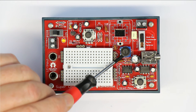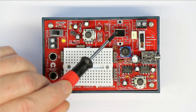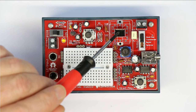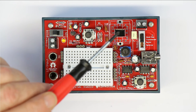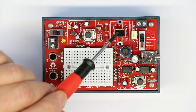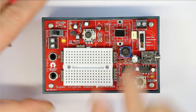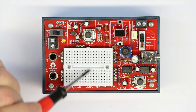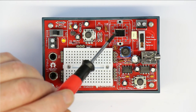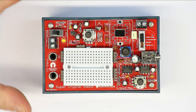And this is also for impedance matching, because the impedance of the transformer is defined only for AC voltages, but with a crystal radio you also have a constant DC voltage, and this just gives the right impedance if you adjust it to the impedance of your load for the DC voltage. You can perhaps already guess there are a lot of tricks hidden inside just to give you the best result.